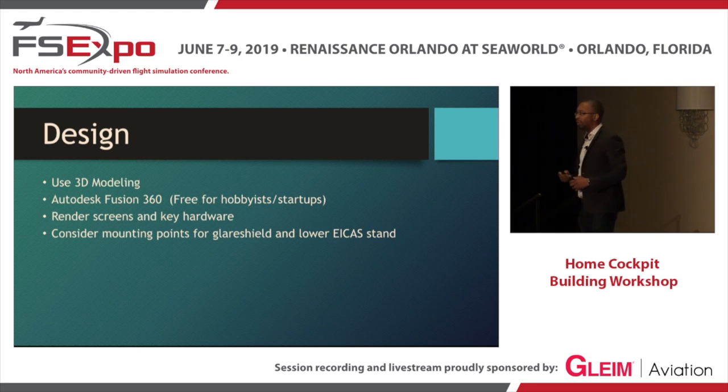So the next step is to design. I use a program, I think you were using the same program, Fusion 360. A lot of people don't know, Autodesk Fusion 360 is free for educational use and also for startup businesses. So if you want to do your own 3D designs, you can go out and download the software right now. This is going to allow you to model, to draw out a piece of sheet metal, to cut holes through it, to do screws, to do threads, to do countersinks, and also to do sheet metal folding, which is key. Because when you do your mounts, you're going to want to actually fold pieces of that metal so that you've got things to put screws into.